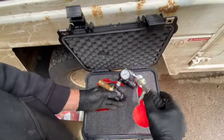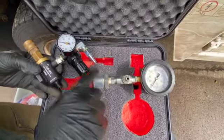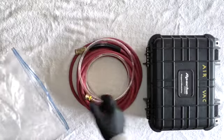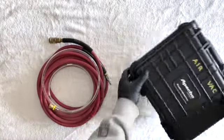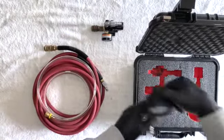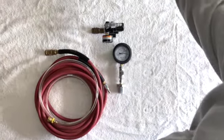This is a vacuum gauge, and it's set up to adapt into the top of the hydraulic tank on the Tiger Cat. So what this is for, and I've run a couple different setups of these on different service trucks, is basically you're putting a vacuum on a hydraulic tank. And then if you've got a major hose or a major component to remove, by putting a vacuum on the pump or on the tank, you can hold the oil in and not create such a mess, which is becoming increasingly important today.